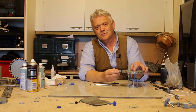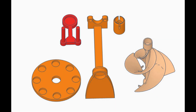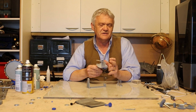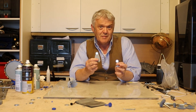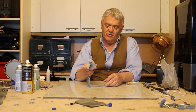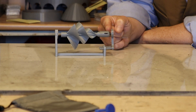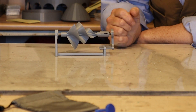We need to do the same thing we did with the needle bearing, but with this larger structure. I drew the rest of this up in TinkerCAD and printed it out. This piece takes our ball bearing with a clip on one side — it just pushes in — and on the other side we need some magnets. I've got these, which are 5mm by 1cm neodymium magnets. I've also put 15mm by 3mm magnets in here, and that slide goes in. There's nothing holding it but the magnetic forces, and the ball bearing has a very small surface area touching — just like a ballpoint pen — so there is very little friction.